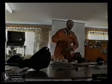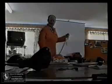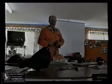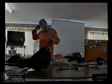Here we have a piece of rope, and this piece of rope was not used in the incident that I'm about to describe, so you can rest assured it's quite safe. When you are working with bits of rope, what's one of the things you should do with the end of the rope? Put some sort of stopper knot in. I find that a half fisherman's is probably the best one, because a thumb knot does have a tendency to come undone.